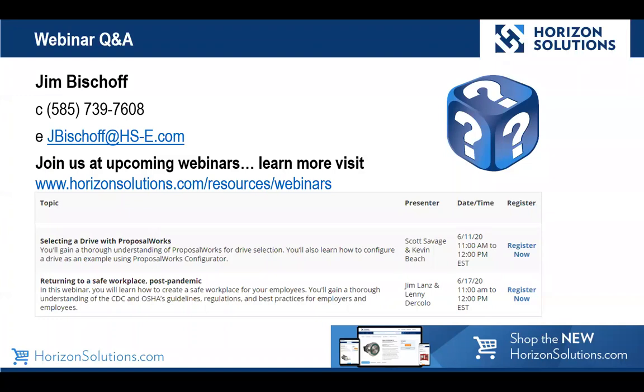On GuardLink, they're not additive. In series wired, they're additive. So if you had 20 OSSD devices series wired, the response time would be slower than those devices on GuardLink. We do have some spreadsheets that show that, and how we would calculate response time, so we can do safety distance calculations. But for OSSD devices, GuardLink likely will outperform series wired.